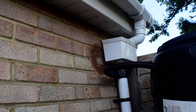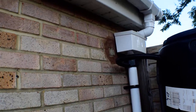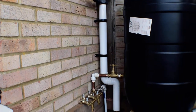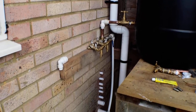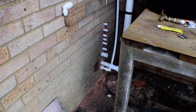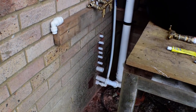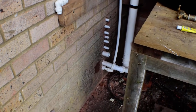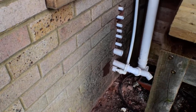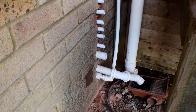It's because I moved the boiler — there was a boiler here. You can see I've just cemented in the flue hole behind the hopper today. I've moved it to the utility, the other side of that wall two metres away in there. But it's got a condense pipe on your new boilers which needs to run into a drain, so that's the main reason — I'll just connect the boiler up to that and run it through here. But it also gives me the option of putting a washing machine or a sink in that area and it will go away to a proper drain. The next one up is a spare one — I just thought I'd do an extra hole while I'm there, inch and a half. That'll be a rainy day hole if I want to do anything with it.